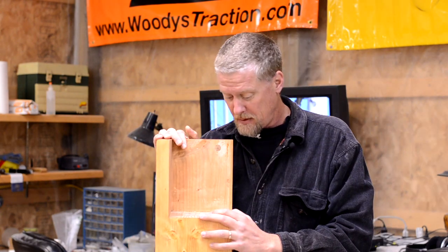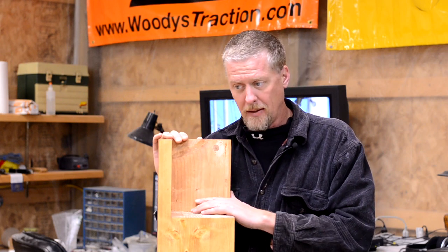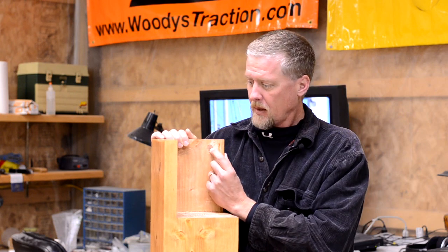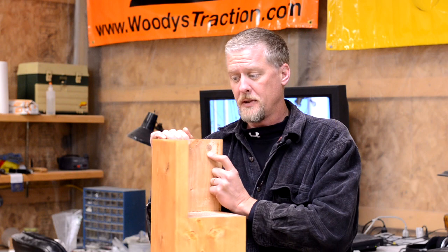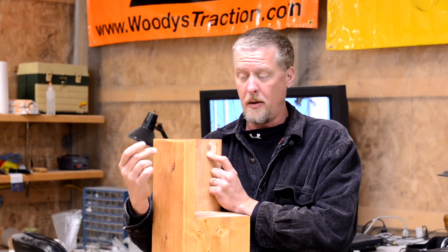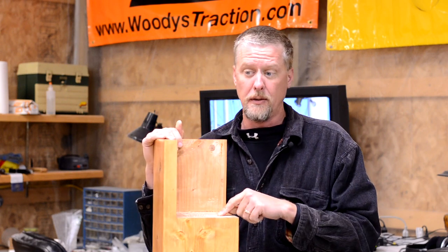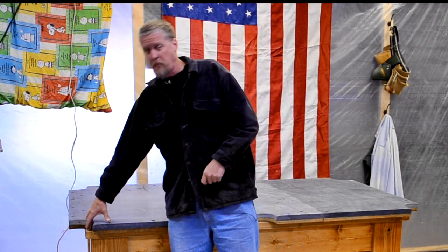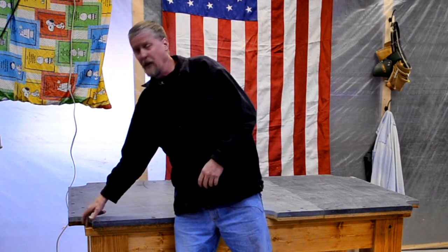As you recall, the legs are attached with screws. I'm going to temporarily attach the legs with clamps, get everything nice and snug, then mark locations of my pilot holes and drill the horizontal holes on the drill press — once again being careful not to go through — and I'll do the vertical holes with a hand drill. Getting close. I've got my legs attached and I've got the slate set in place, and that is some heavy stuff. I did need to get some help with that. The only thing left to do on the frame is to cut off the areas of the frame that protrude from the pockets, but I won't worry about that until I'm done with the rails.